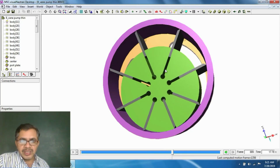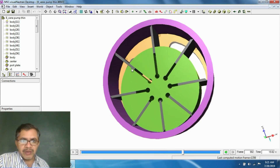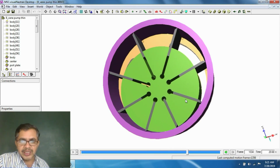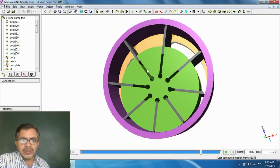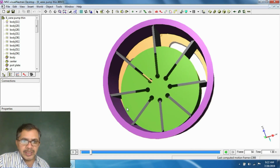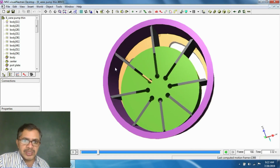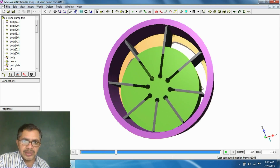You can see this animation. This is the cylindrical rotor, and there are radial slots cut in it. Vanes are inserted inside each and every radial slot, and the rotor is rotating. As the rotor rotates, pockets are created — the size of the pocket grows and increases on one half of rotation, and now the size of the pocket is reducing on the other half.